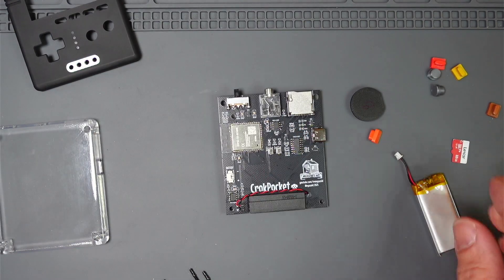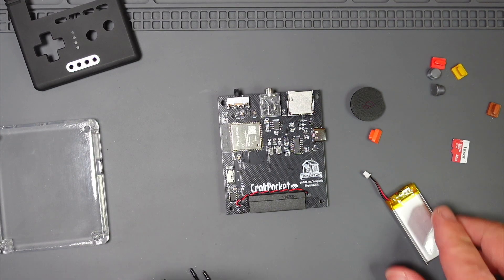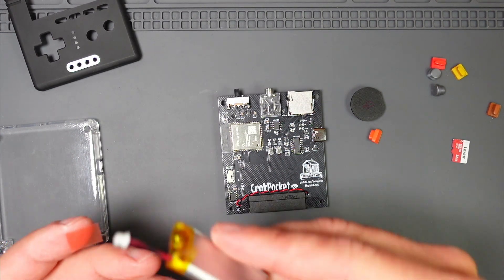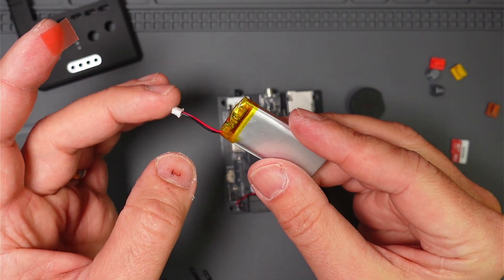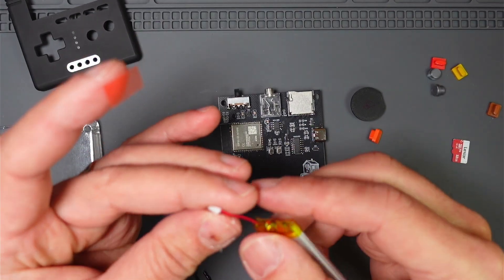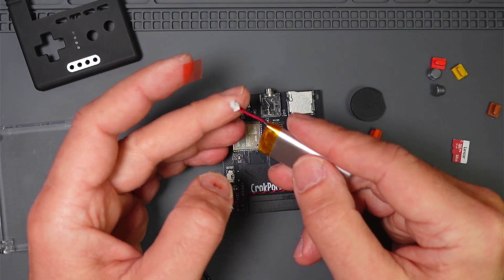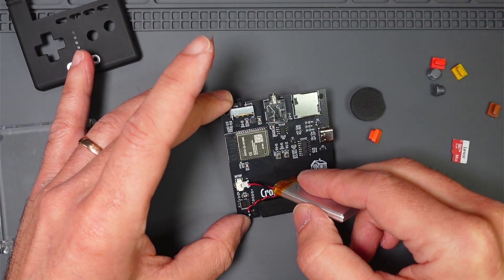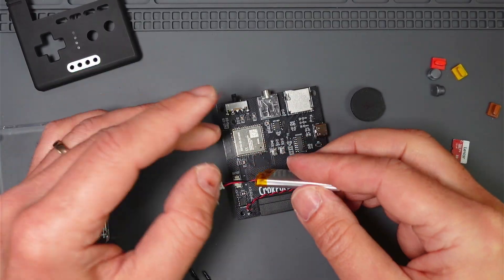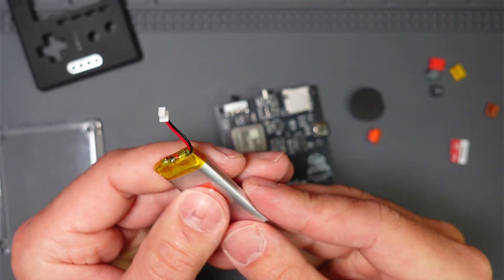Just the battery — that's just a bit of double-sided tape as well. I don't think you should go too mad with this on the battery because in the worst case scenario you've got to rip it off. I've shortened the lead and done that properly. You've also got to be very careful to check the polarity because I'm getting a lot of these batteries where they just switch them around at random. I've already checked that and had to alter it.